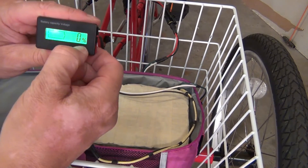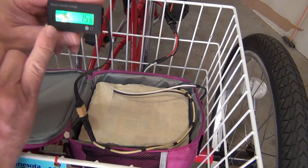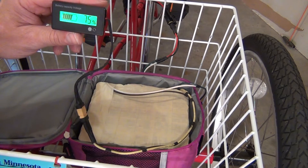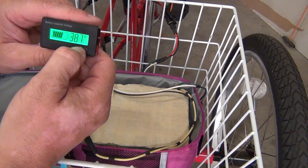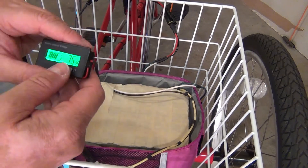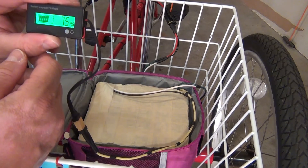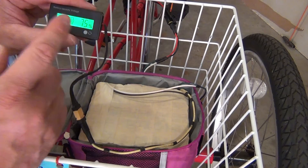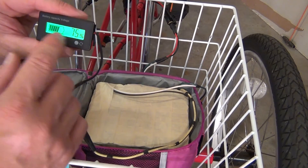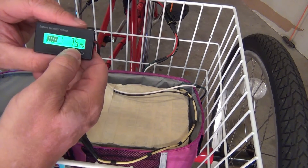There are many uses for this. I think it's great for e-bikes — you can strap one of these on to your battery pack and keep an eye on your percentage. I hope to build some sort of box for my battery and put this on the cover, so while it's charging I can keep an eye on it and maybe cut my charging off when it hits like 90 percent. While riding, I can keep an eye on this because the screen on the bike isn't as accurate — this is reading based on how many cells I have, so it's very nice.